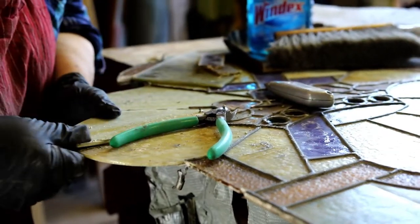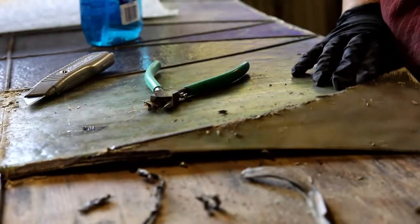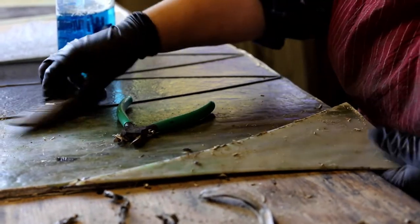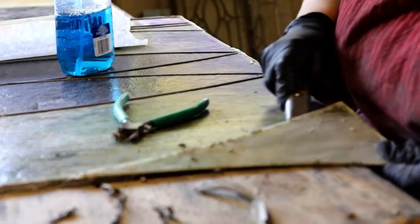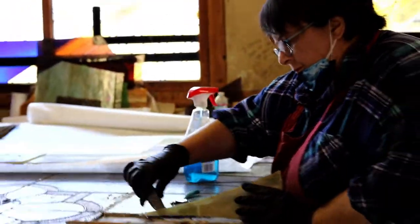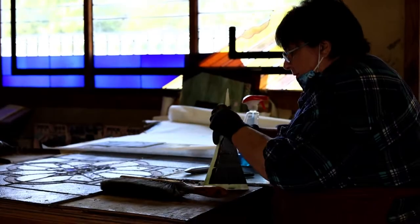Some companies are still making the same lead — it comes in different widths and shapes, and they have channels in them so the glass fits into the channels in the lead. That's why we then have space we have to re-putty to make them waterproof and solid again. After 45 years you learn all the tricks of how to do all that. Lisa's good.